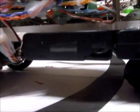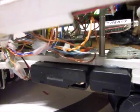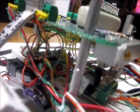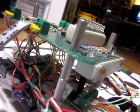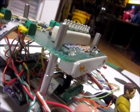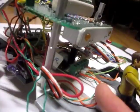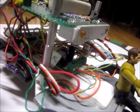Also underneath, you can see we have double-A batteries — there are six of them. The six batteries are there so I could use rechargeables and have enough voltage to drive the Arduino and the motors. Looking at the other side, there is a handmade terminal board in the front made for power distribution. It brings in the battery power on one side, which is approximately 7.4 volts, and distributes it for the lights and the wheels. The other side is 5 volts. The 7.5 volts goes to the Arduino, which gives it some headroom for its 5-volt power supply. The 5-volt supply then powers the photo transistors and the ping module.